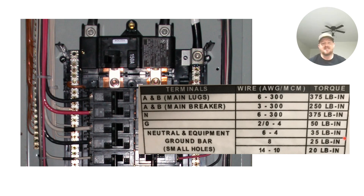If the torque value isn't listed on the enclosure or on the device itself — breakers often have it right on them — you'll find it in the paperwork that came with the panel box or with the box of switches or receptacles. Sometimes you have to look up the manufacturer's specifications online, and you'll find that a lot of brands are very similar for the same product. Always make sure you know your torque spec.